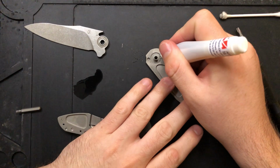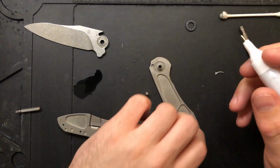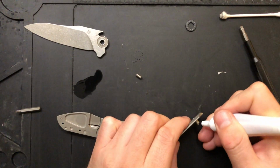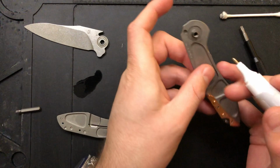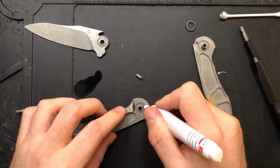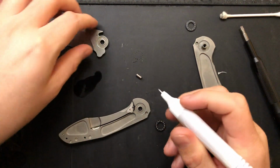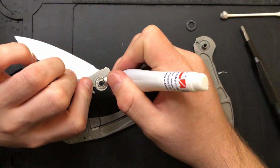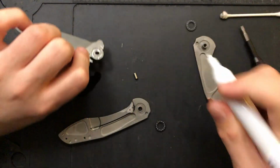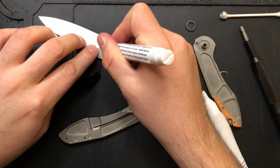So anyways, let's go ahead and put this guy back together, and I'm actually going to use the 5-weight nano oil, because the action on this guy is very, very quick. And so I think the ultra lightweight oil might be helpful here. So I'm applying a little bit of it to there and to there. I'm going to go ahead and apply some here and here as well. That'll just let things be very quick. Okay, that was a little too much. There we go. And then I am going to apply the 10 weight right here to the detent ball path.